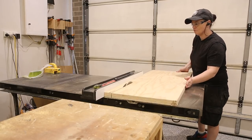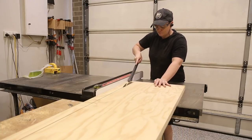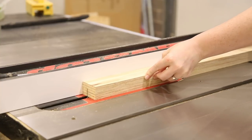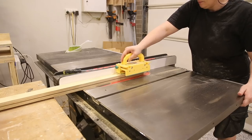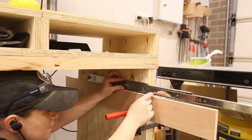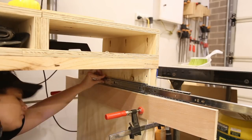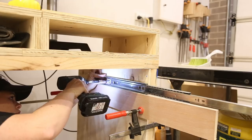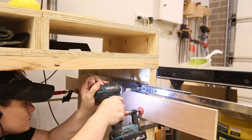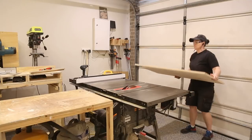The third section of the bottom is for a pull-out router table. I started by cutting some 30mm strips of plywood to give me good meat to attach the drawer slides to. I used 18mm plywood for the top and rabbited out a section of the 30mm plywood to accept it. I considered whether to put the table lower so the fence system is always in place, or higher so it's comfortable to use but requires removing the fence system when not in use. I went with the higher option as I thought it was more important to be at a comfortable height. I installed the drawer slides on each side of the opening before taking the measurement for the top.